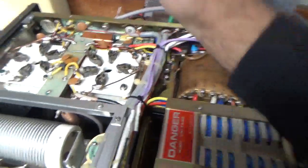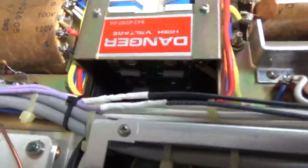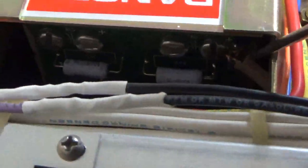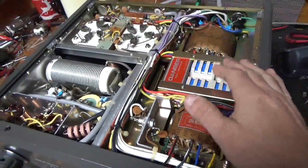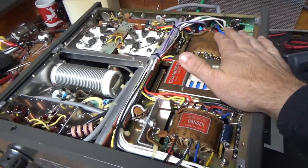The band switch looks okay. See that screw — it's backed out of the capacitor — and the B+ connection is not even soldered, just stuck in there. Please, I like seeing people trying to do work, but if you're not 100% confident, please just let me do it. It just adds more time and increases the price. I'm going to go through this and make it better than new. It's getting a set of Pentalabs tubes.